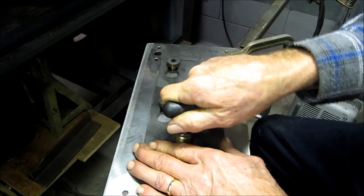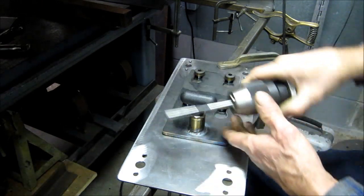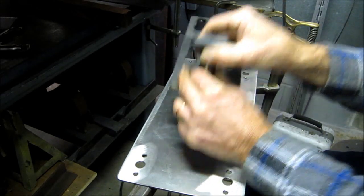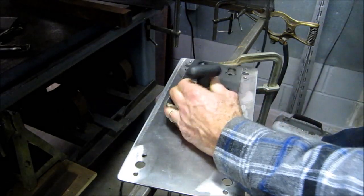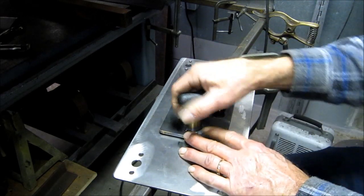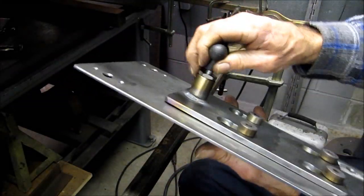We're going to have to work that hole just a little bit. We did make a reamer attempt, but we were off by about fifteen thousandths or so. I went ahead and took a rotary burr and just barely kissed that — actually it could use a little sanding now. But now it locks right in there, I still have to tighten that nut. You can see about fifteen thousandths or so we had to come off there, but we've got good action out of it now.